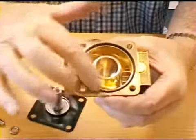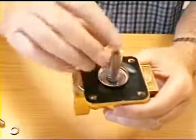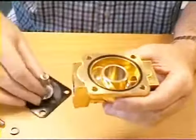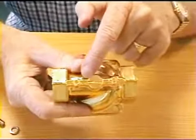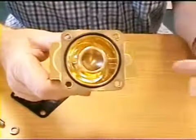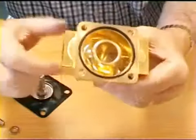There is the seat of the diaphragm, and there is an O-ring on here which helps it to seal off properly, like that. And this little spring just helps keep it down tight. The media, water or air or whatever you like, goes in the direction of this arrow in this particular manufacture. So it goes in there and comes out here. And as you can see, looking in there, the media comes in there, comes over the top of there, down there and out of here.